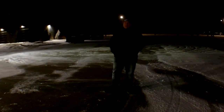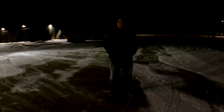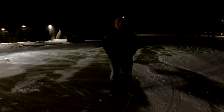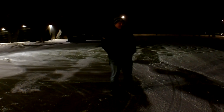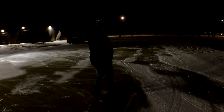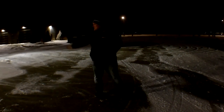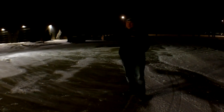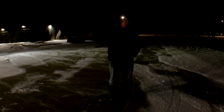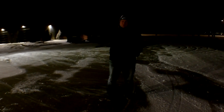We're back here checking out the results from our spraying yesterday. We only got about an inch of snow — on the low end of what they said — but the wind they nailed; it's been horribly windy for the last almost 24 hours. This is about 24 hours from when we sprayed and exactly what we expected happened. Here's the 95.5 — you can see a very definitive line exactly where he sprayed; the snow stuck to it. The untreated spot I'm standing on, almost nothing stuck to that. The straight salt brine, not quite as definitive. We came and checked this morning and the straight salt brine hadn't totally started accumulating snow yet, because we're below zero right now and straight salt brine really doesn't work below zero — that's why not as much stuck to that treated surface.